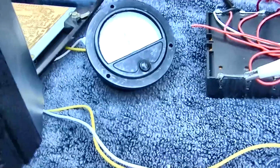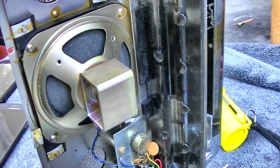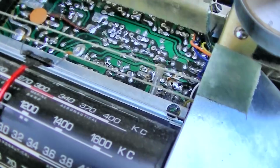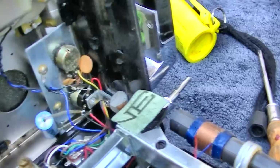Okay, this volume control has to go. I'm done with this. Okay, vax. All vax, all the time. So, FM is super... Oh, I got the volume control sprayed here. You gotta spray it where the wires go in, and it's no more crunchy.